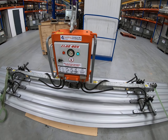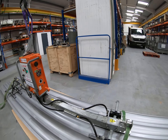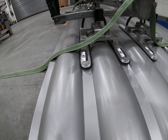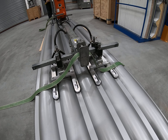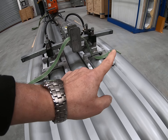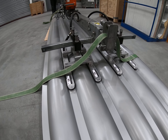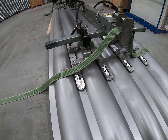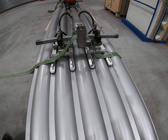We're going to demonstrate the suction once more so you can watch what happens to the suction pads — they move two or three millimetres down to the panel surface when suction is applied. If for some reason you're unable to achieve suction, it's because the pads are not located correctly on the panel surface and something is preventing them from pulling down. With this curved panel, it will usually indicate that the pads are being caught on the shoulder of the shape. Pay attention to the position of all eight pads when trying to achieve suction.